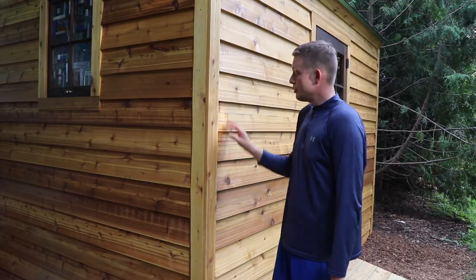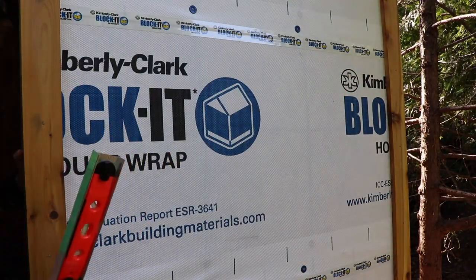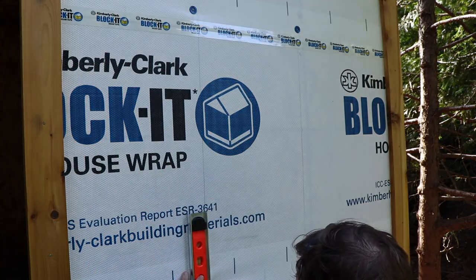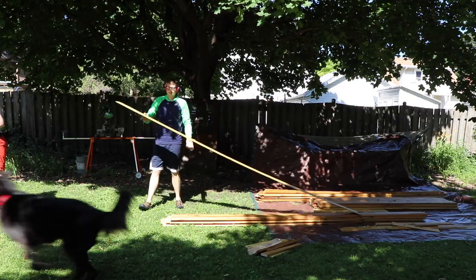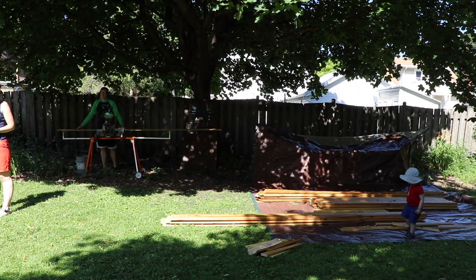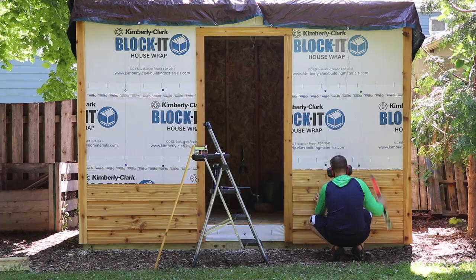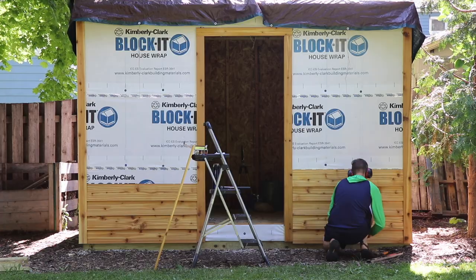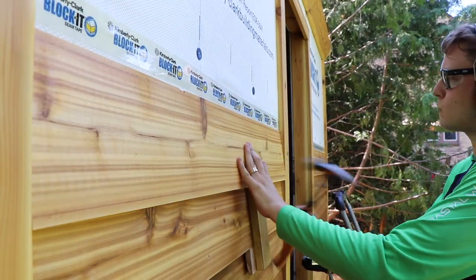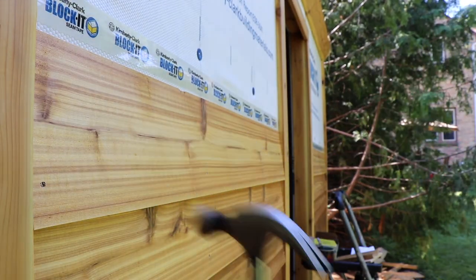Once the trim is up, it's time for the most fun part — putting on the boards. Step one is to measure the space between each trim piece, then cut the boards. The measurements won't be identical on both sides; for example, I was off by about a quarter of an inch from the bottom to the top of the door. So you can't mass-cut them — take the time to cut each one individually. Before you put a board up, be sure to apply your exterior finish to the freshly cut ends so it soaks into the fibers and doesn't gray out. Cedar is naturally rot resistant, but you still don't want the exposed ends slowly turning gray while the rest stays that beautiful amber.